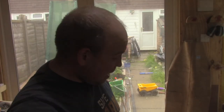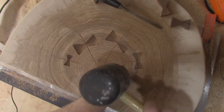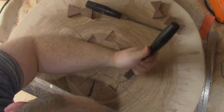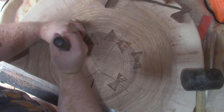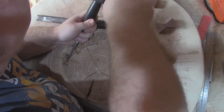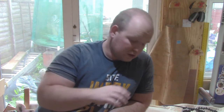Okay now I'm at a depth that I'm happy with. I'm just going to go and clean up all the edges with a couple of chisels. Okay so they're all done — chiseled out, hoovered, nice and clean. Now if you remember we used a Stanley blade to cut the wood, so hopefully these are going to be really tight in the holes. I've just tried one out and it's nice and tight.